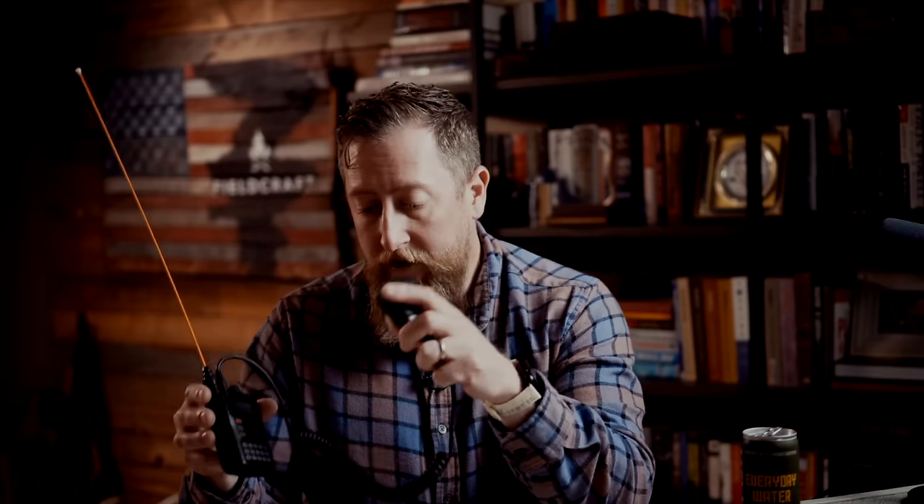Let's assume you're on a multi-day hike, or maybe just a day hike and something happens and you're out there longer than you think. Some of these batteries don't last very long, particularly if you leave the radio on or accidentally leave it on in your pack. There's another recommendation I have: wires that allow you to take USB power from a power bank — a simple USB power bank like this 10,000 milliamp-hour power bank — and use an up-converter in this little box that will step the voltage up to 12 volts.